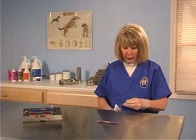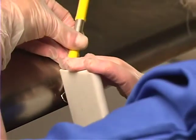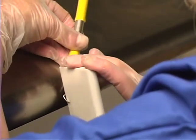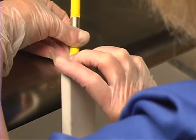Flipping the instrument again, placing it so the face of the blade is facing upward, engaging the stone against the cutting edge, opening it out 70 to 90 degrees, 2 downstrokes, and walking it around the rounded football toe with 2 downstrokes as you round it.